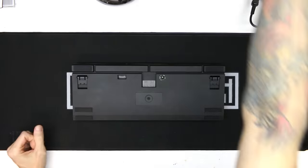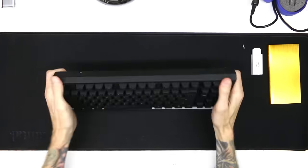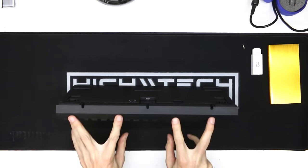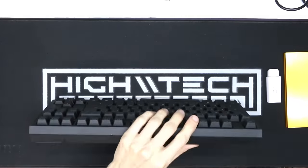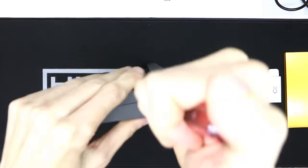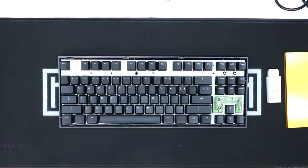To get into the case, rip off that warranty sticker and remove the singular screw. The case is held together by 12 clips. Start with the back 4 clips as I'm showing you here. Position the reflection of the light to more easily see them. Also, start with the 2 innermost clips. With a screwdriver or pry tool, you're going to want to push hard enough to release the clips, but not so hard to break them. For the bottom 4, you can just slide them without prying them.